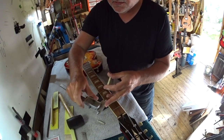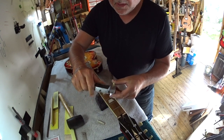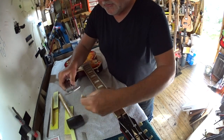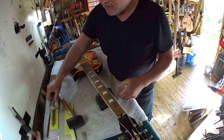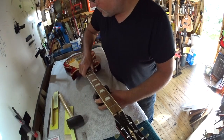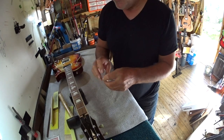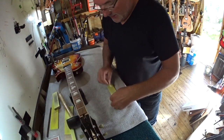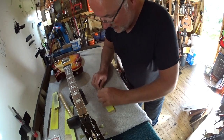I'm going to set to zero, so we've got a gap here of 5.7, and if we look at the bottom of here, that will be 6.3. So we've got a bit of reduction to do there still, and I've got to eyeball this now and see where it's going to come from, and I can see it fairly clearly. So I'm going to take it down by hand.